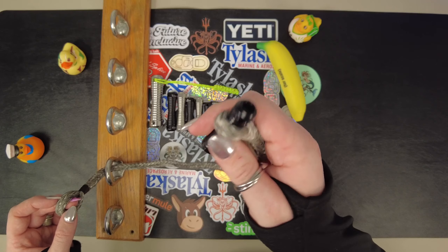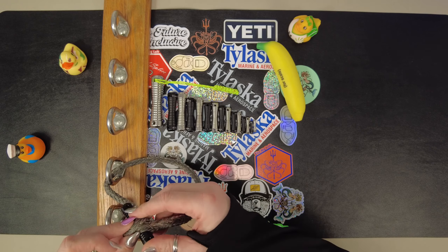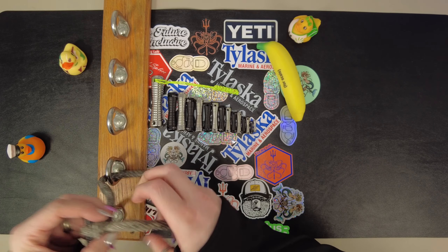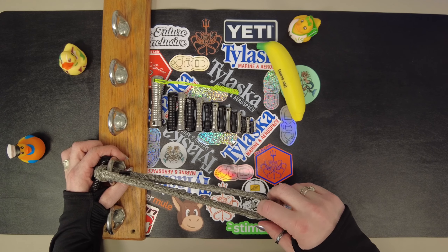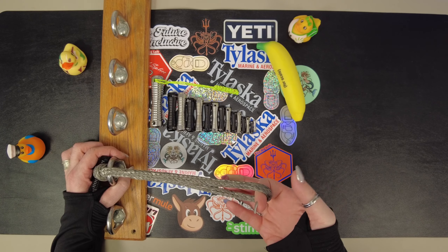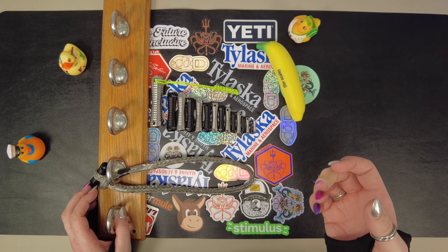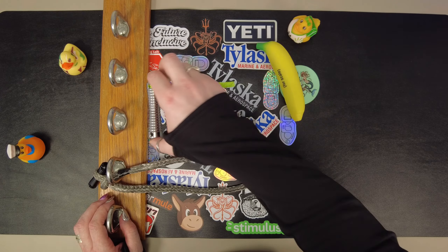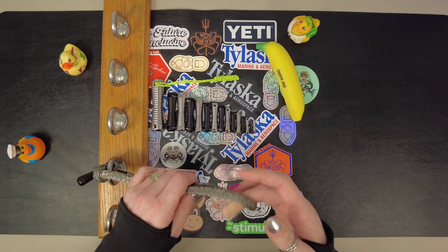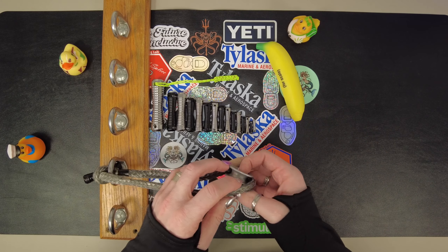You have your dog bone on this end that's spliced in, and then you have a spliced loop on this end. You simply feed the dog bone through, center it up, and then you have a very nice, very strong strap — similar almost to a soft shackle. The difference being, I don't think I would trust a button knot with nearly 23,000 kilograms. Once you have this loop, you can attach anything to it, like a low friction ring or a block.